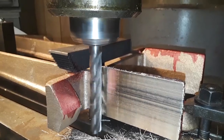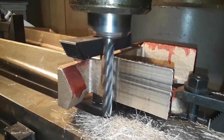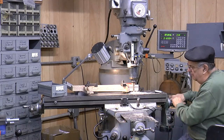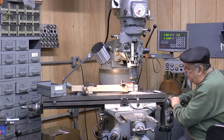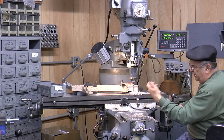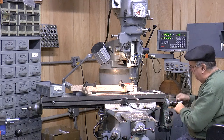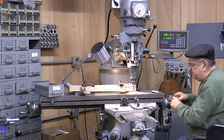The original — that was aluminum — and tightening it down, it was springing all over the place. This is a lot better. Now you've got to go from this way, because the other way will be climb milling. So you want to cut like that, and then on this side you want to cut the other way — so it comes around and goes that way. You've got to remember that; it's very important. Because if you try to climb mill, it will jump — there's a certain amount of play in the machine. Ball screws, CNC — we don't have that. We got this. Works.